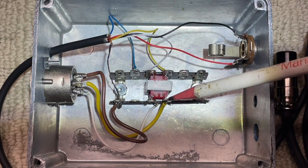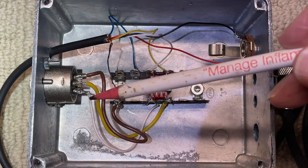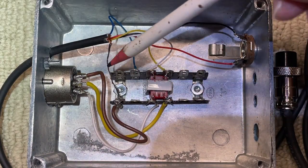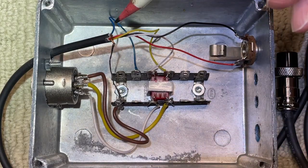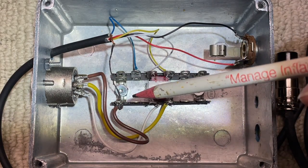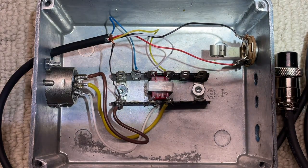On the transformer, I wedged it between the two solder strips for support, which also let me put wires through the lugs and solder them without it being too fragile. The yellow and white wires from the main cable coming in from the radio are wired to the same side of the transformer — those are hot going to the radio. On the other side of the transformer, I kept the color codes the same: white comes from XLR pin 2, which is always hot, and yellow is XLR pin 3, the neutral for the mic. Pin 1 uses a brown wire that grounds to the case. I took the shield from the radio wire and pin 1 and grounded both to one lug, which in turn grounds to the box itself.